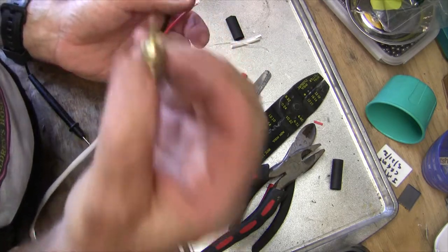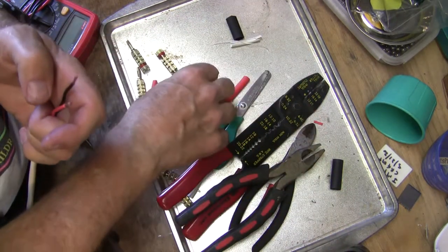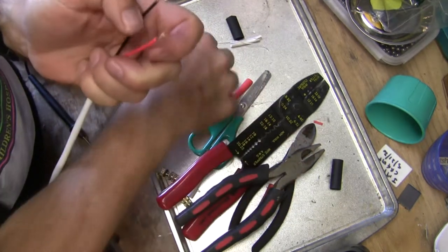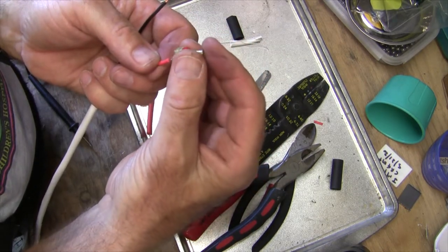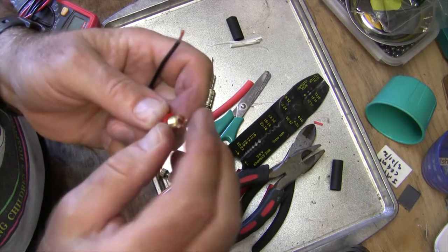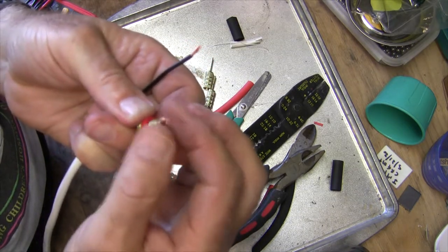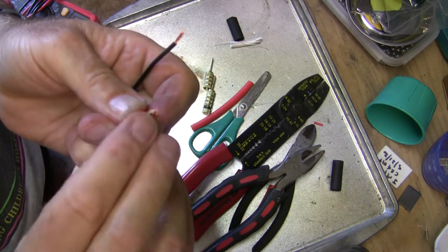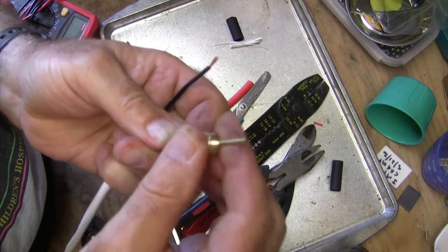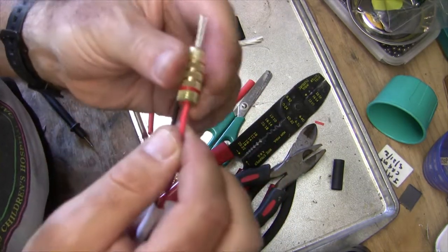We're going to do the pin side. These are the pins that go into the speakers, and these are the banana plugs that go into the back of the receivers. We want to make sure we line up the colors — red and red. So we unscrew the bottom of this, push the wire up to the bottom, make a little mushroom, and bend over the top. You've got to make sure you don't go onto the threads, otherwise it won't work. Then screw it down tight and give it a little tug to make sure it doesn't come out.